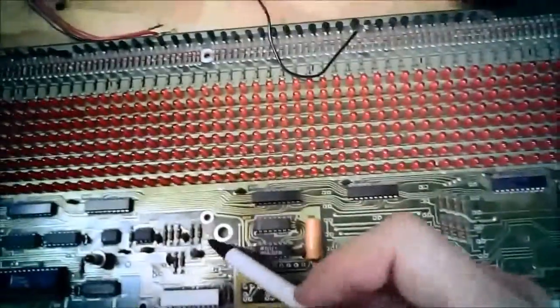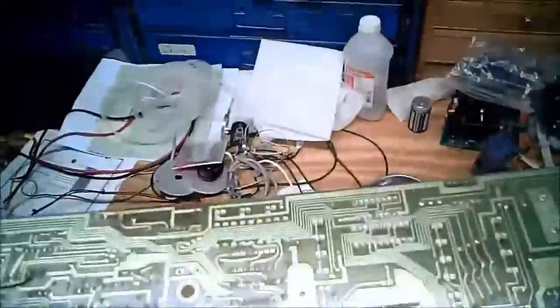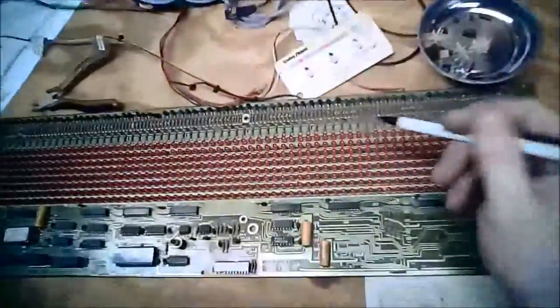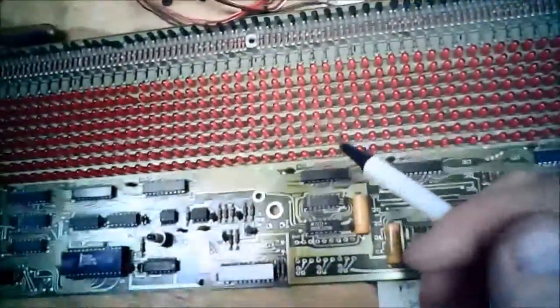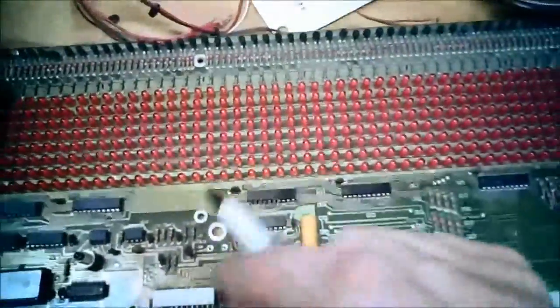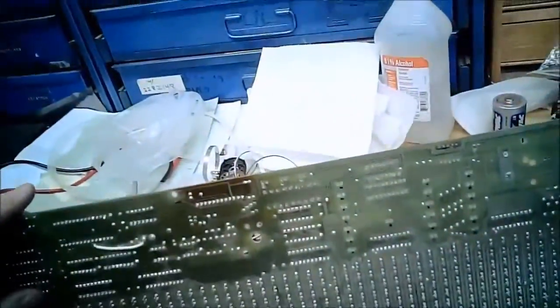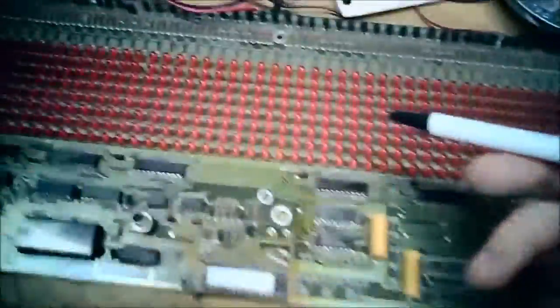So whatever this pen input was, it must have been active. I mean, there was no power supplied from the card, I don't think. Hold on. Nope. That outer ring is not connected to anything. And there was no power from this card going up this pen connector. It had ground on one side and this little weird input circuit on the other pulling it down. Now, maybe this was some sort of input gate so that the circuitry over here could shut down the pen input to keep noise out. I'm not really sure yet.